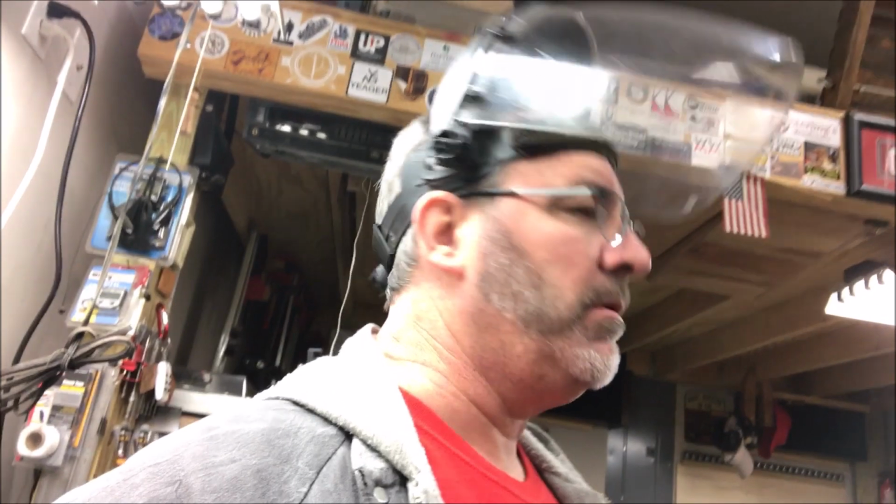And what I found is I moved my belt over on the lathe end, not on the back end, but on the lathe end. I moved it over one notch, which slowed the lathe down, gave it a little more torque, that low end and that heavier torque. And I cut through it in about a fifth of the time.